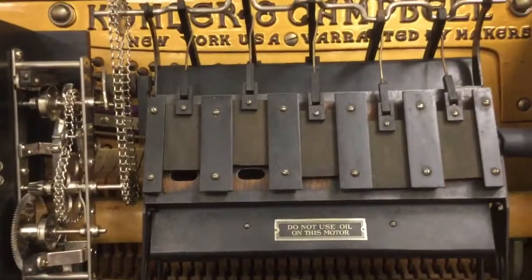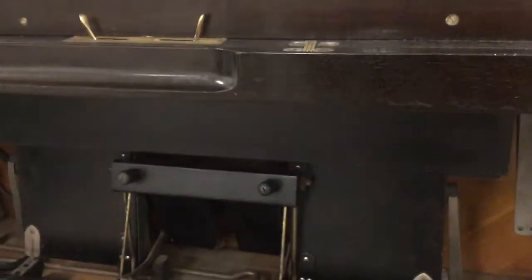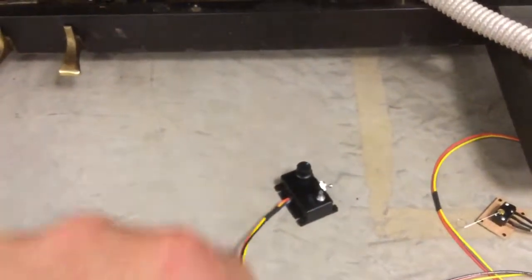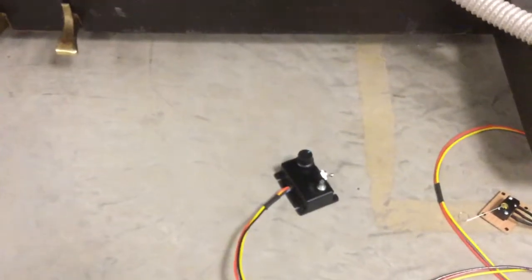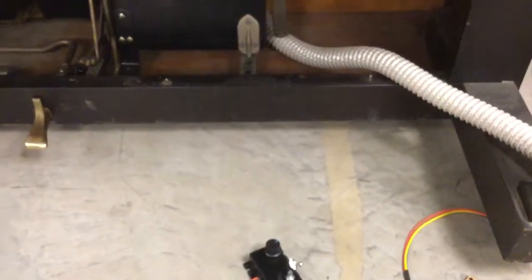It's reached a point where it's pausing now, where it's opened the sustained pedal pneumatic. That's where I like to operate this — I think that's the proper operating position, right where it just closes. That would be the maximum vacuum level available to a person foot pumping the piano, and I would think that's also the maximum permissible vacuum. The trim pot allows you to adjust the minimum speed of the pump, but the maximum speed is fixed. The suction box produces 70 inches water column of vacuum, which is pretty substantial.